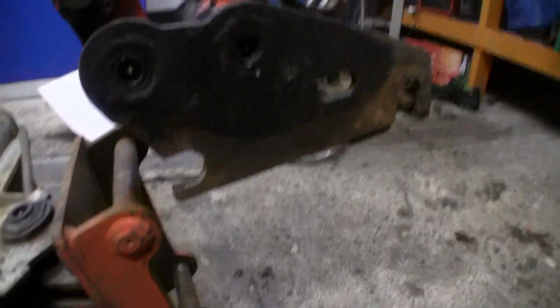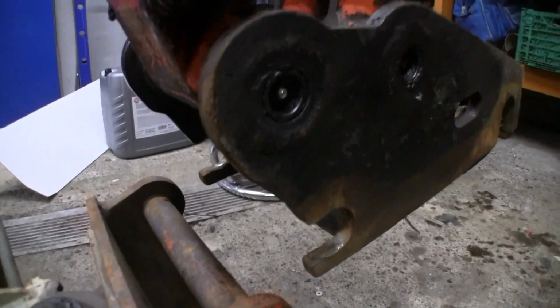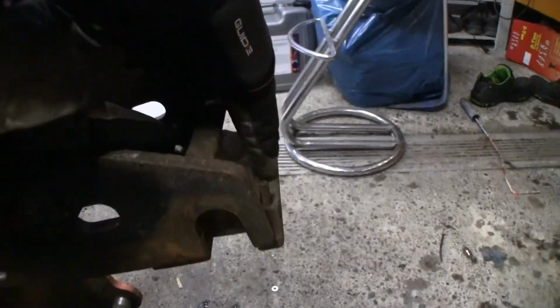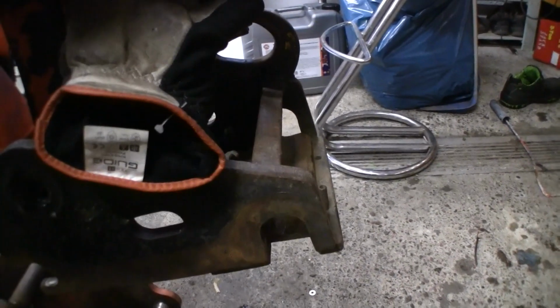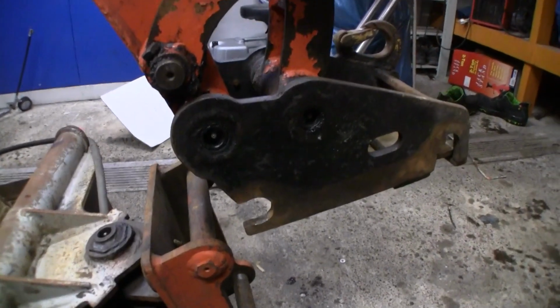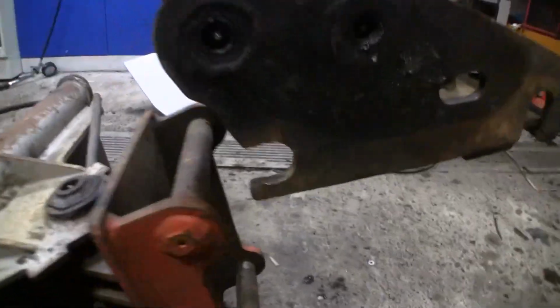So for putting the bucket on, it's just putting this bolt in these two hooks, and then you pull the latch here back again with the rebar or something, and then your bucket is connected. And of course then there's the hydraulic for this one, but if it's another one, you don't need that. So let's just put it on again.